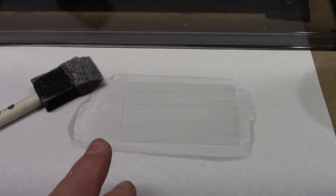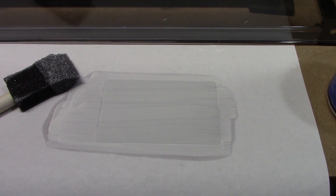The denatured alcohol will evaporate quickly leaving whatever the magic powder is coated on our material. So let's get that done. We'll get a brush, paint some of this on, and we will go into LightBurn and do a material test. I have no clue what settings we're going to need, so that material test is a fantastic way to get started. Let's go to our laser tools and pull up the material test — the business card painted with our compound.